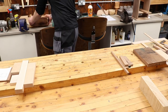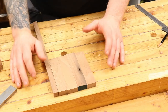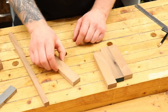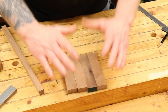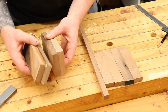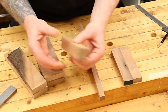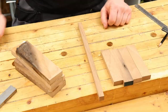The first thing we want to do is make up our little blocks for the inside of our puzzle. I'm working with 15 millimeters, so it's going to be 15 by 15 by 15 — those are our unit cubes, and I need five of them. Then I need to make six which are two units wide by four units long. I just glued up some pieces for the ones that are going to be four units by three units — essentially two of those stuck together and then three units long. I'm going to take these to the planer thicknesser now and get these milled up to the correct dimensions, then cut up our little blocks.